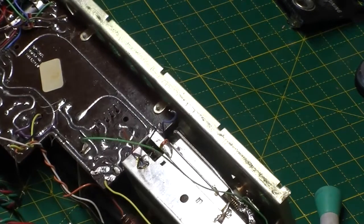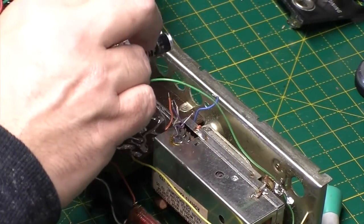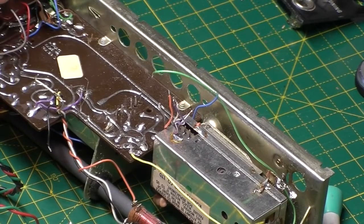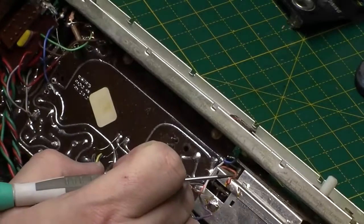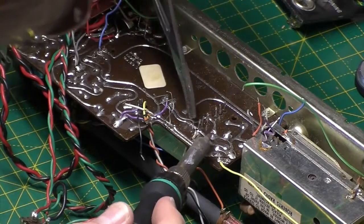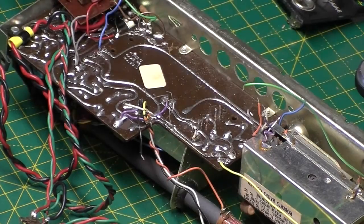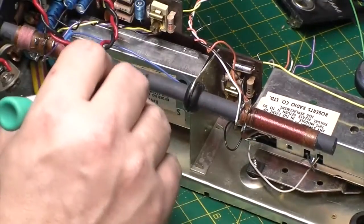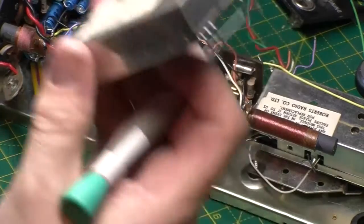A little bit trickier up here because we've got 2 pins that are in underneath this capacitor, and they've decided in their wisdom to put the capacitor real awkward as well, just so I can't get at it. So I'm going to turn the desoldering tool on, so bear with me, I'm going to get that taken out. Okay, that's all the pins on the module desoldered. There's one there that's not quite. There we go. So it should just drop on out. There he is, the module.